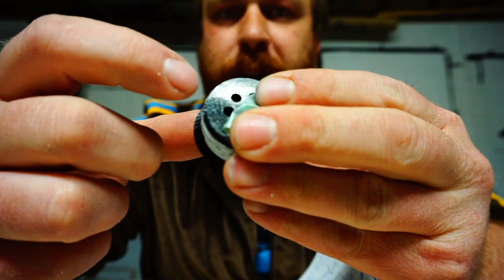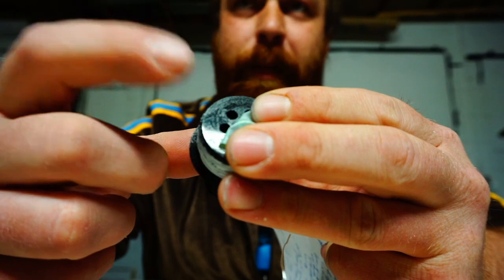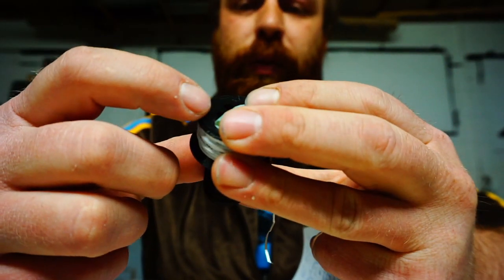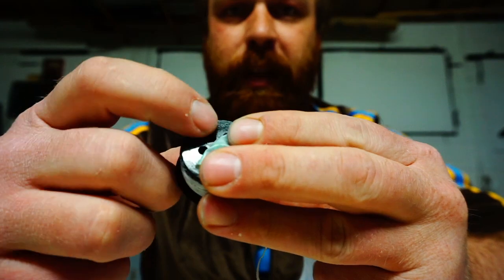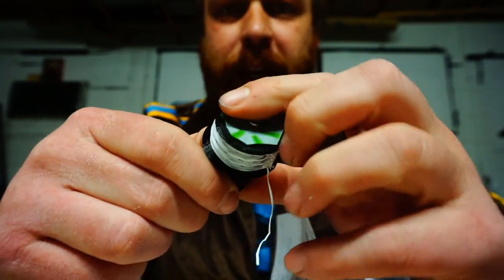It's really important also that you print it against a clean glass print bed. No masking tape, don't use a textured bed, don't use glue sticks — just use a perfectly clean glass bed, maybe with some hairspray to get this smooth finish, which is really important to make this air tight on the inhale stroke.